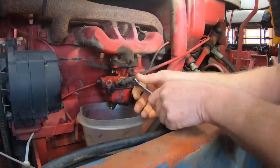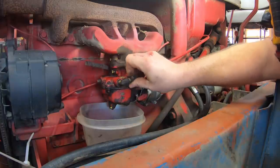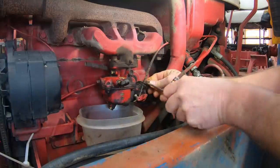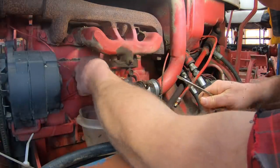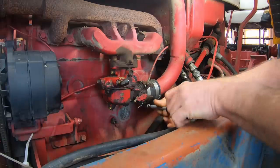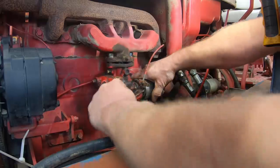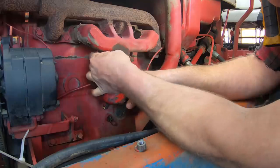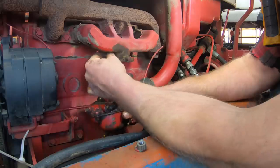First thing I'm going to do is disconnect the fuel line. There's fuel in it, so it's going to drain out. I turned the fuel off at the sediment bowl so there won't be that much. We'll disconnect the choke cable and take that off. Take off this spring that I used to compensate for the governor's sloppiness — hopefully we won't need that anymore. Disconnect the air inlet and take the carburetor off the intake manifold.